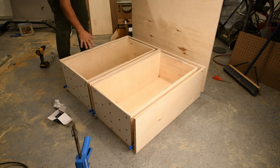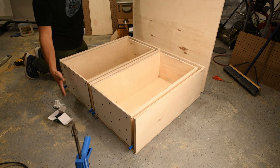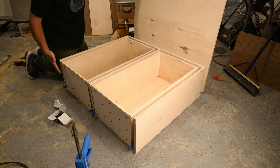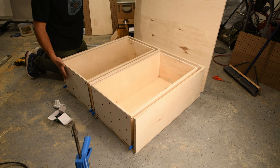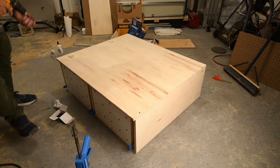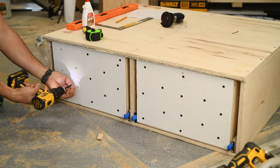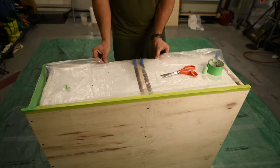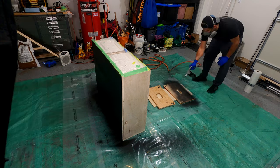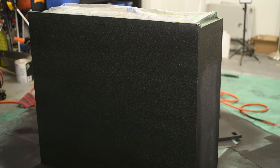We're now ready to put the lid on top of the box. You may notice the shims on the front of the drawers — these are one eighth inch material screwed and glued in place just to make sure that once the drawer fronts are on, they won't prevent the locks from going in and properly closing. I then removed the screws holding the shims once the glue dried, applied some poly to the front, and secured it with tape to prevent Raptor liner from getting into the drawer slides. I applied the Raptor liner using a pneumatic spray gun, but you can use an aerosol can — I'll leave links in the description.